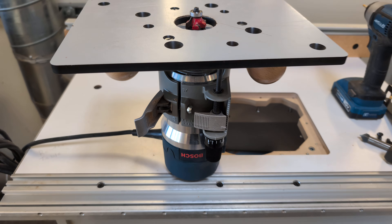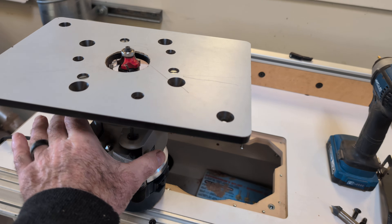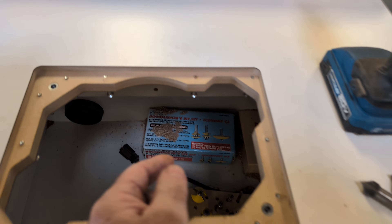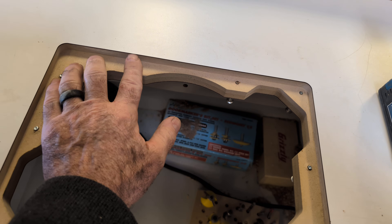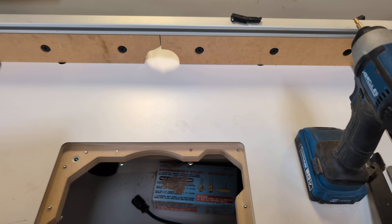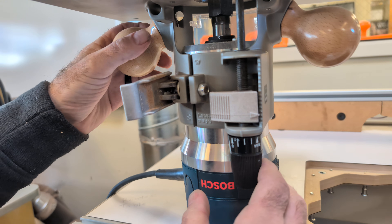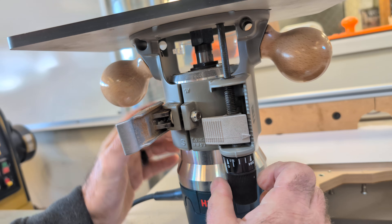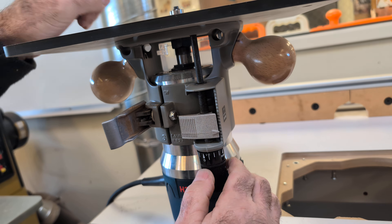Let's figure out how to tighten this up when it's outside of the table so you could see. Before I go over tightening that up, let me show you how this thing sits. The screws down in these corners here — these screws right here adjust the overall height of this plate. You want this plate to sit just a little bit prouder so when you run your material it doesn't catch on this edge. This is a tightness adjustment: this locks it down in place, this unlocks it, and this drives it up or down. As that plate comes down it's really the router going up, giving you more and more cutter.